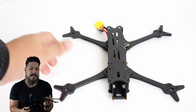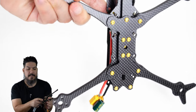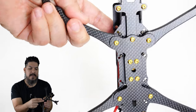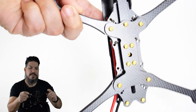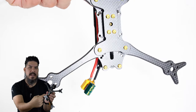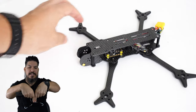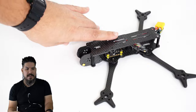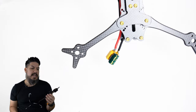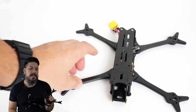Another notable difference on these two frames is not only do you have this very thin shaped bottom plate, you have this long sandwich plate right here that really helps you get absolutely no arm wiggle. The design of these arms — instead of kind of straight, it's actually a straight and then an elbow — means you have a longer portion butting up against each other, and you have two screws that hold them in place, with absolutely zero room for this to ever wiggle.